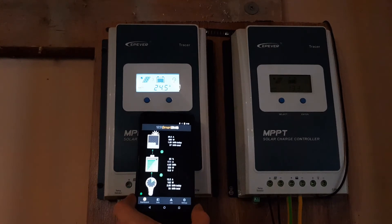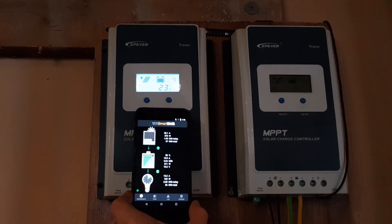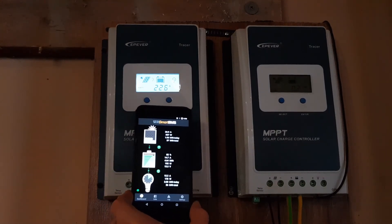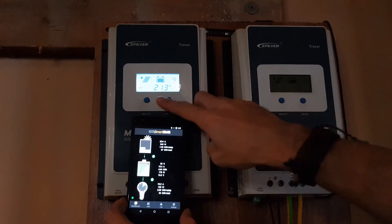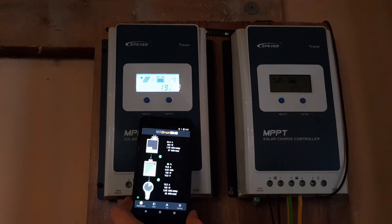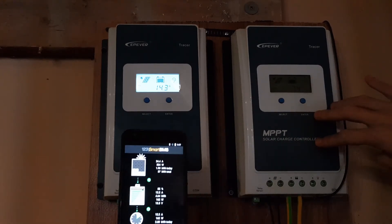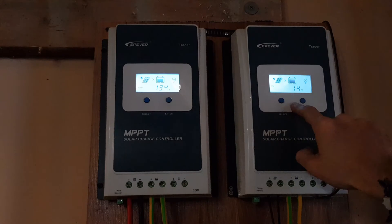It's going to drop down to around 16 amps, just like a PWM controller. In the next video I'm going to do a side-by-side comparison of these EPEver charge controllers and the Victron Energy charge controllers, so you can see these are just toys from China. It was supposed to stay at 32 volts — that's the MPPT voltage for these panel types. These charge controllers just don't do their job. It's back down to 14 volts.